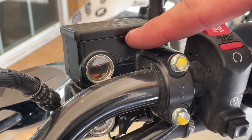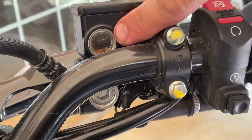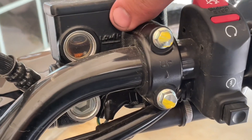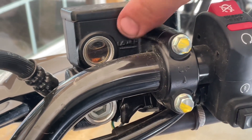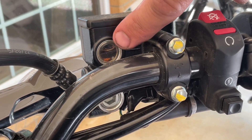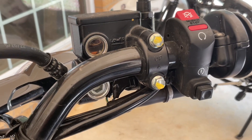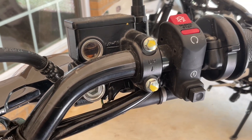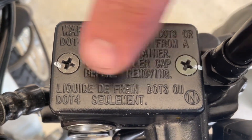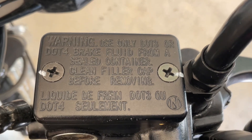This is your front brake lever and there's your front brake. Here is your sight glass for your brake fluid — it says 'lower,' so that's your lower level right there. As long as the bottom of your bubble — the top of the fluid — is above that lower level, you're fine. On the rear brake there is no sight glass because it's drum. Right here it tells you that you can use DOT 3 or DOT 4.